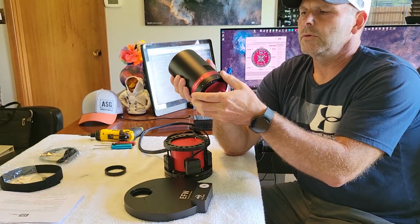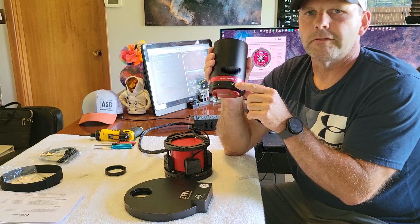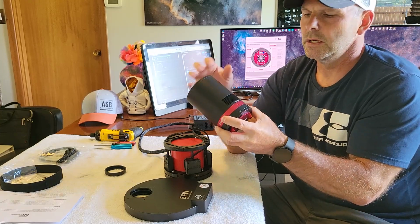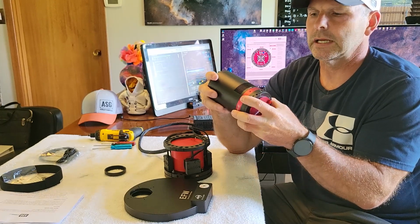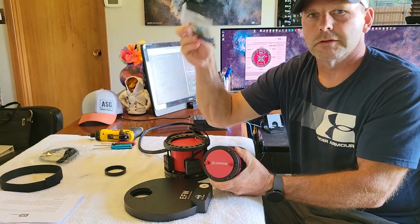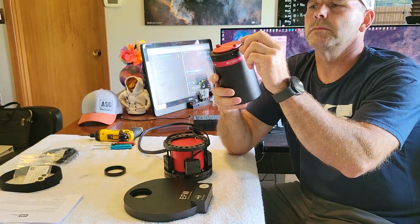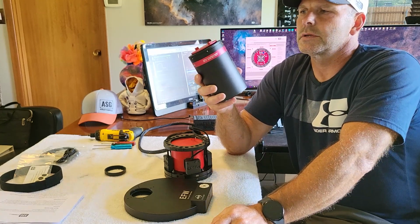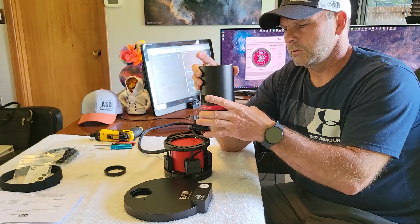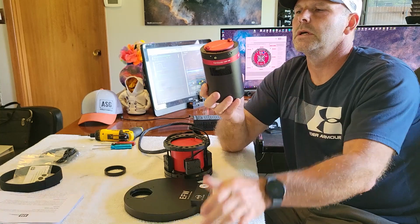The thing with QHY cameras is they often come with desiccant ports that stick out. And what you can do is use little M5 set screws and put in there. I wrap them in Teflon tape. Some people can put some kind of thread locker on there, something to keep them from going in and out, because a regular set screw just kind of is loose. We also provide some of those if you let us know you have a QHY camera. Some QHY cameras, like the color cameras, often come with a dovetail, and some people have asked, does it work with some of those dovetails? And yes, it does. It will still fit down in there, and it'll still clamp the camera by the body, just not as much. So those work too.